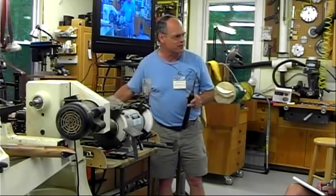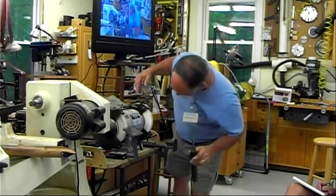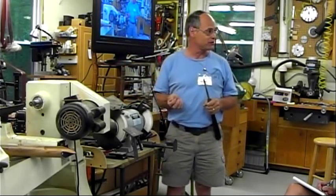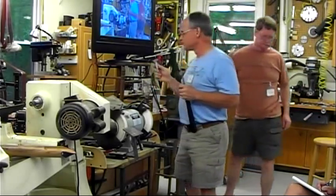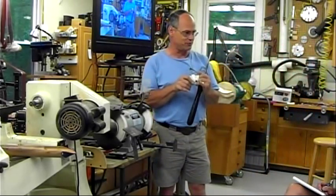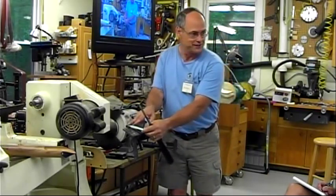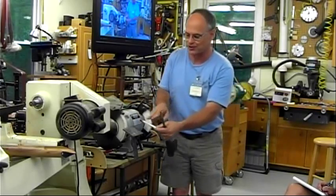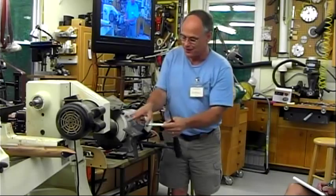Any question on sharpening? This wheel's nice and clean. It comes with a little T-bar. You got one. There it is. And it's got diamonds embedded in the front. Always use this with the plate. If you freehand it, it's going to bounce enough, and then when you put the tool on, it really exaggerates it here, and you slide it back and forth real lightly, and it grinds away the stone, gets you a nice flat surface.